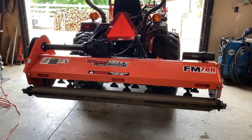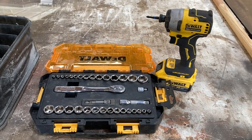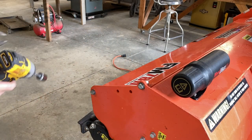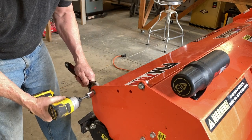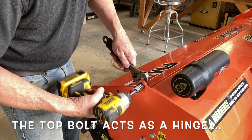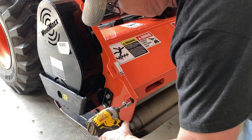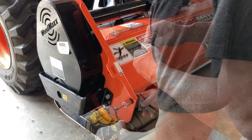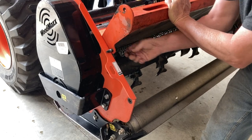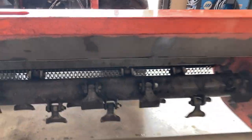I'm going to show you what I do to sharpen these blades with the minimum amount of fuss. I'm using a driver and an 18 millimeter socket to take a couple bolts out. I just have to remove these two lower bolts on the outside. I'm going to loosen this up just a little bit, and the same thing on this side. I'll drop a nut in here to keep the shield up. With that rear shield flipped up, all my blades are exposed.